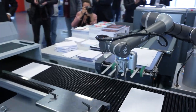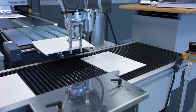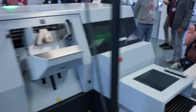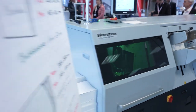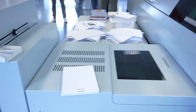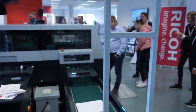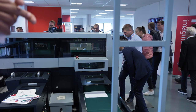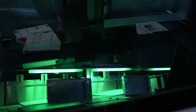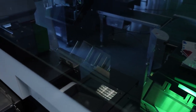Book by book is fed on the conveyor through our new end sheet feeder, the ESF 1000. The books then leave the end sheet feeder and are transported to our LBF 500 — our loose sheet book block feeder — and our perfect binder BQ 500. We transport the book, stop it, measure the thickness, set up the binder, and there goes the binding. The LBF 500 is capable of running cut sheets, folded signatures, or sewn book blocks. Books are jogged in two stations, and at the moment we're running about 500 books per hour.